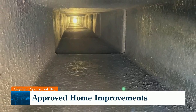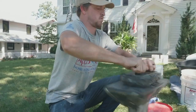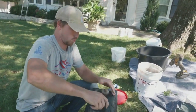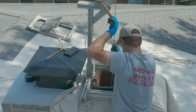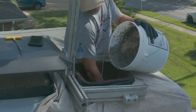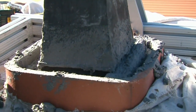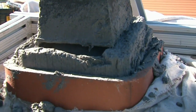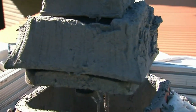But what about those gaps and cracks in the flue up higher in the chimney? That requires a little more engineering. A foam form, built to perfectly fit the home's chimney, is lowered from above all the way down to the bottom of the flue. Then more of that heat shield sealant is poured down the flue on top of the form. Using a winch, that form is pulled back up the chimney, coating the flue with sealant like a four-sided foam paintbrush — filling every void and making it like a straw with no seams. The cracks and gaps are gone.